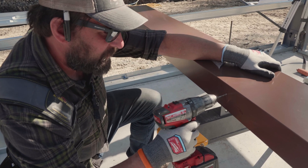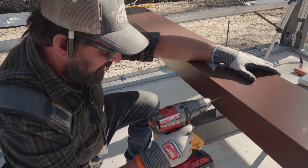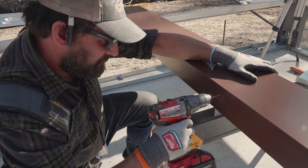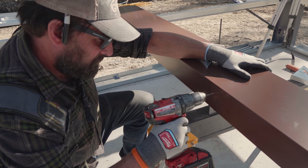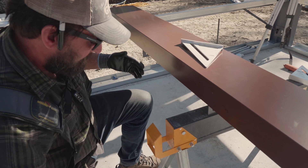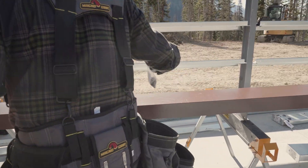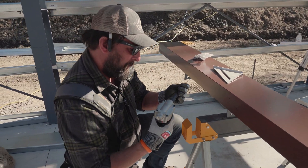I have my mark and I know where I'm going. I'm going to be real careful not to over-drill this and smash the drill into the face of the trim, or at least if I can. You can do that a lot faster, obviously, but you run the risk of smashing it into the trim and you will see that scratch on the outside later.